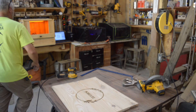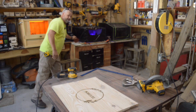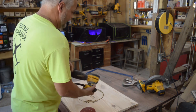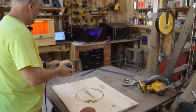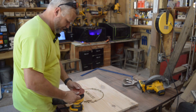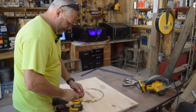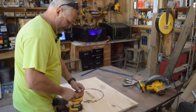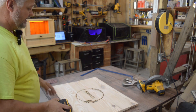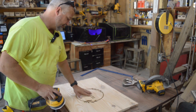I've got the other stove cover started on the engraver and I've got my 80 grit. I'm going to take that off because when I touch these up, I usually do it in 120. I run them down to 80 grit before the engrave, but after that I stick with 120 just to smooth it down a little bit more and make sure I don't take a whole lot of material off.